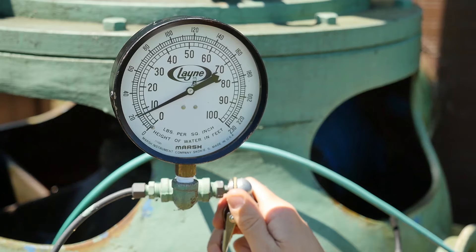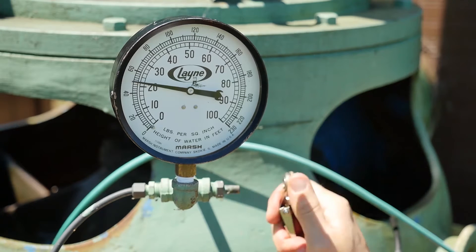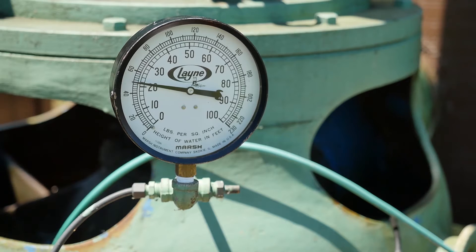Often, not enough air pressure is used to purge all the water out of the tubing, resulting in a bad reading. Here you can see that not enough air was used because the needle didn't fall rapidly back to our reading. Again, if we pressurize it more but still haven't purged all the water out of the tubing, the needle still won't fall rapidly.